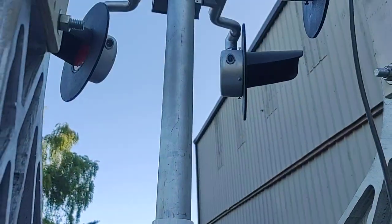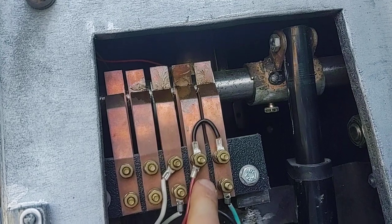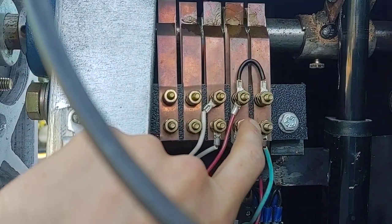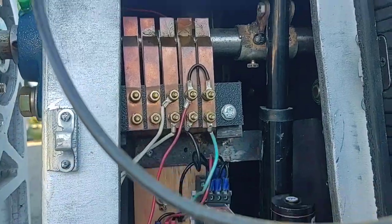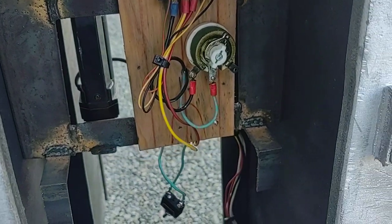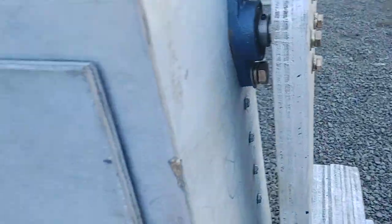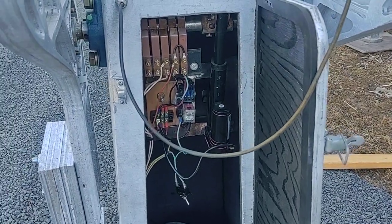When these contacts open, as a safety, it will cause the lights to flash. This one I believe is the power up contact, and that will open when the gate is in the fully raised position. Then there's the power down contact, and going to the back side here — that is wired into an adjustable resistor to control the rate of descent. I did not put one on the power up because I wanted it to clear a lot quicker than it goes down.